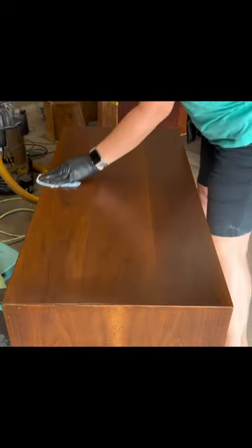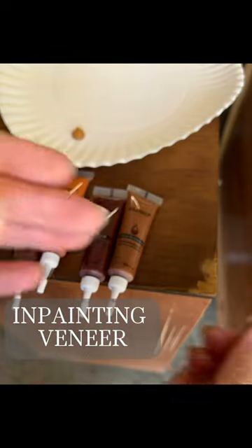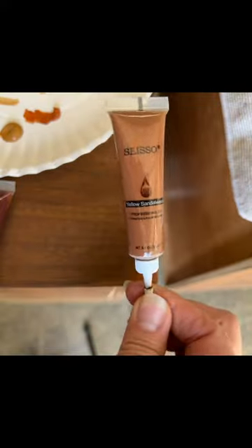Followed by the gel stain. Then I'm going to move on to in-painting on that area of veneer that I patched — starting with a light color, drying it, then going on to a darker color, continually trying to blend it in to the surrounding wood.